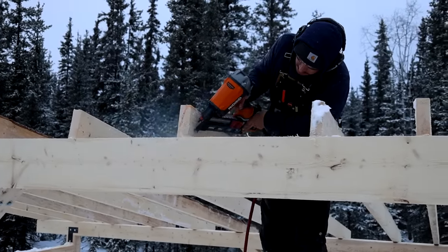And just what that means is, if you go out 12 inches, a foot on the roof, and then you go down and hit the roof again, that's your angle. So we are at a 3-12 because it dropped 3 inches, and the front was 8 inches. It dropped 8 inches, so much steeper. So that's what it means when you hear 6-12 or 12-12, and I just learned that recently. I didn't know that up until a few days ago.